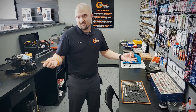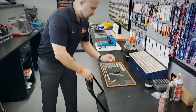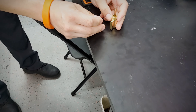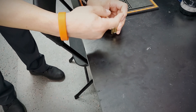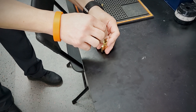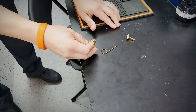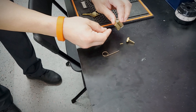It gives you a little extra security though, because the blank is a lot harder to find. So it's a lot harder for people or employees to go get copies of your keys made. First things first, just like rekeying any other key and knob cylinder, I need to take the tailpiece off the back. If it was going in a lever, you want it to be straight up and down; if it was going into a knob, you want it to go sideways. I'm going to take this tailpiece off by pushing down this little pin here and just spinning the back of it off. Then I'll set that aside — the pin and spring that holds it won't come out, but it'll stay in there.